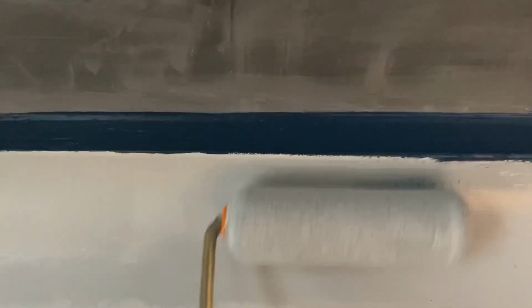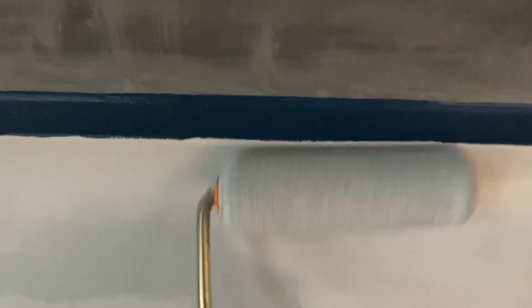In that case, I hate when I see even a 32nd of an inch of one color onto the next side. I always find that it's best to go with what I call a dry sponge roller, just introducing the color on the corner with a very mildly wet roller. And then you keep rolling it repeatedly over and over again, and you control how much color goes onto the corner. Let's see the rest of the video.